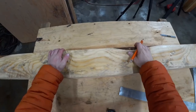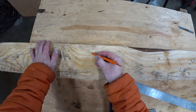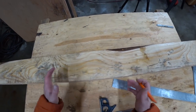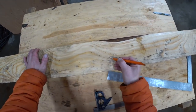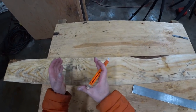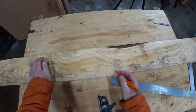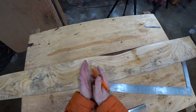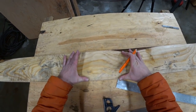One thing that we should know about scarf joints is even though it would be really awesome if we could just lay out the scarf joint something like this and cut it, we can't. Because there's no way to make this cut right here. At least not easily. So we actually need to cut this piece in half first, and then we'll need to lay out our scarf on either side, and then we'll have to join the pieces together. If this dimension here were 24 feet and this were 24 feet, you would actually need a timber that's slightly longer in order to create this joint.